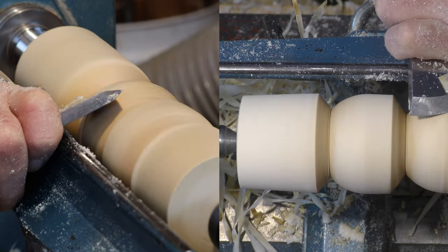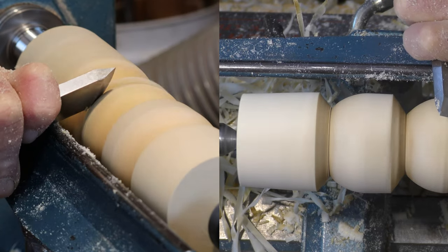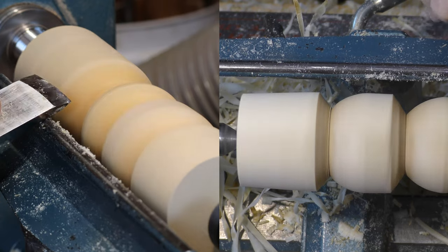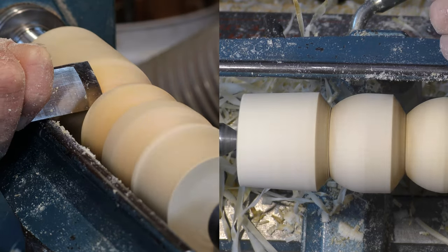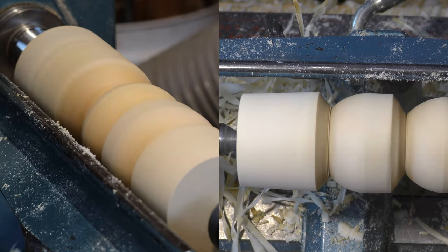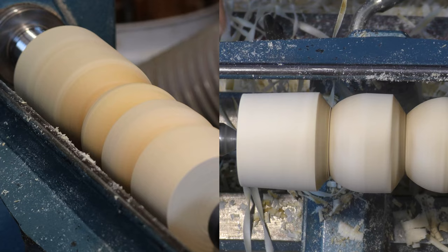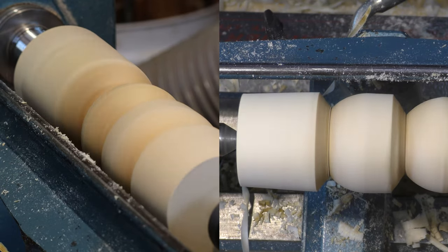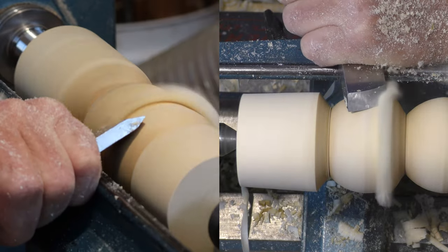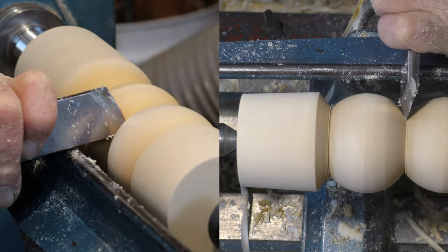This one's short corner — I can hear another knot in there, just that little knocking sound. If you can't see what you're doing with the short corner going in, you can take the tool away, turn it over and come in with the long point so you can see what you're doing. There are teeny little frills at the bottom of a V-cut or bottom of a pair of beads — you don't need to lean in there with pressure, just go very delicately. The nearer to centre you get, the slower the wood's running, so you just have to be a little bit more patient. Roll it around, just flick it over and come into the bottom.